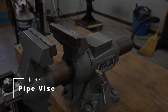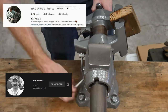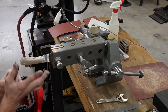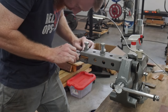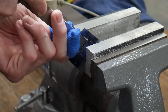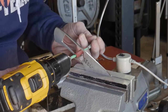On the eighth item on our list we'll be working up in the price zone — let's talk about a good vise for the knife maker. I got turned on to pipe vises when watching Nick Wheeler and Carl Anderson. With the ability to rotate, they allow the knife maker to manipulate the position of his or her knife just about any way they want, which is extremely handy when sculpting handles. This vise is most useful when coupled with a knife clamp, as seen here in the footage. A set of soft jaws is also a really nice addition to prevent digging into your workpiece. I've had mine for about a year now and couldn't imagine turning back.